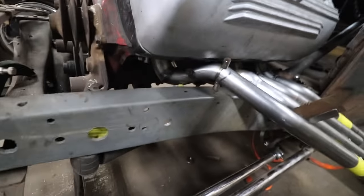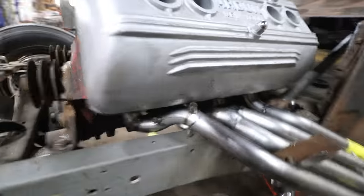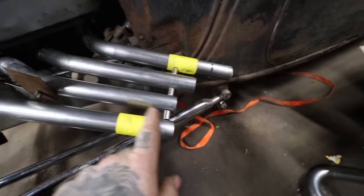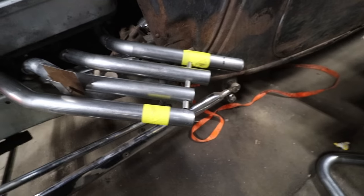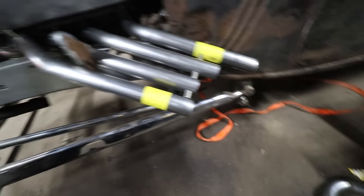You got to really make these bends. You can see what I have to do. In this plane, you could see that it goes down almost 90 around, and on this plane, it also bends this way. And then we're using these, I got a crap ton. These Eastwood stitch weld magnets are the most frustrating thing on the planet, but also the most helpful. Not because of poor product quality or anything. They're rare earth magnets, really strong, so you can hold stuff together, but they sometimes will grab on things not how we want.